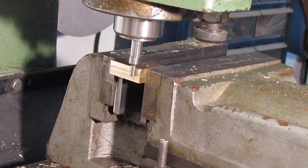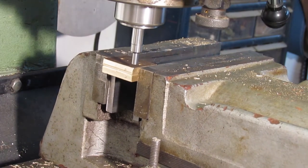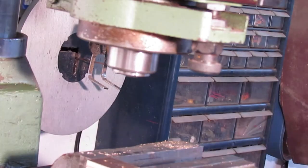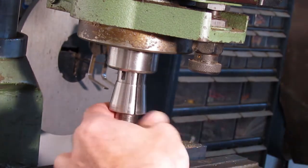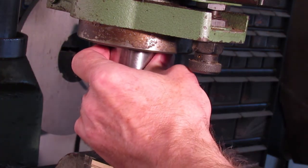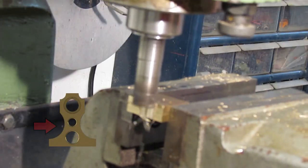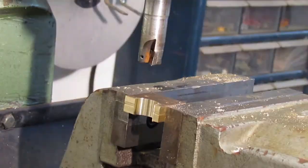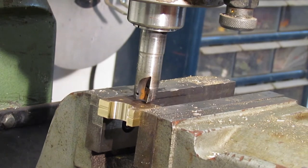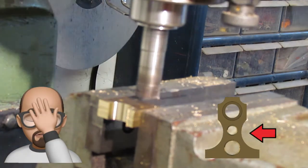At this point I once again edge find both corners and travel to the predetermined locations. The large radii are being milled. I didn't have a 20mm diameter end mill so I used a ¾ insertable carbide end mill. I proceeded to mill the radii on both sides in plunging steps feeding along the X axis. Sorry, I didn't realize the camera went out of focus during the plunging but the process can still be seen.